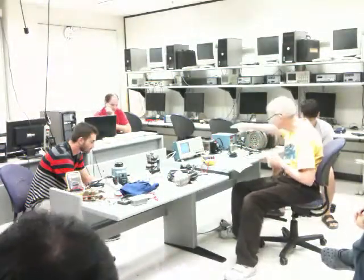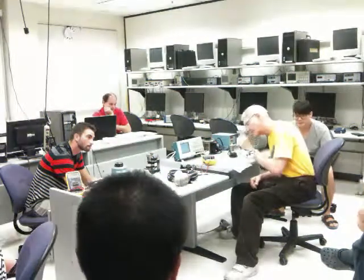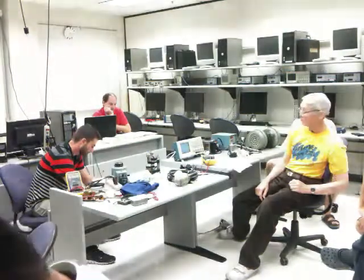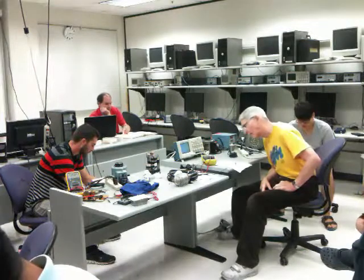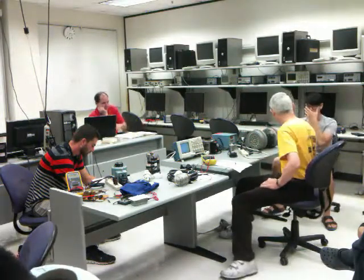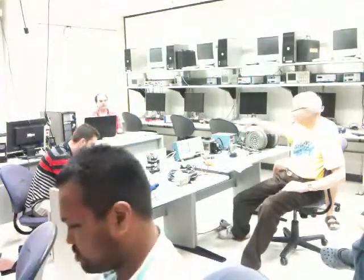Okay, so we got 120. How many amps should it be? 1.8. Well, with the capacitor in place, no, just the capacitor by itself. Calculate the IRMS for the following loads. We've got the 120. And 40 microfarads, what's the current supposed to be? 1.8.